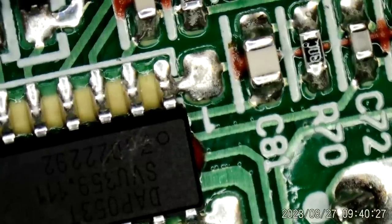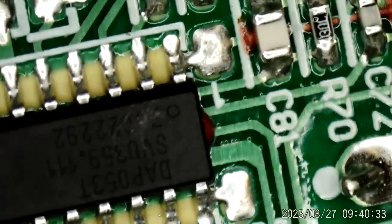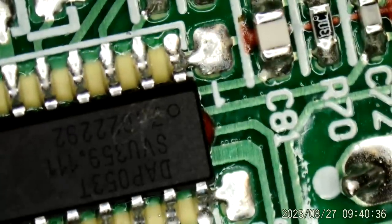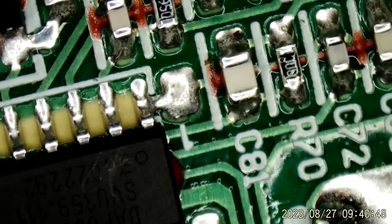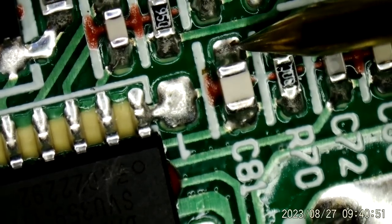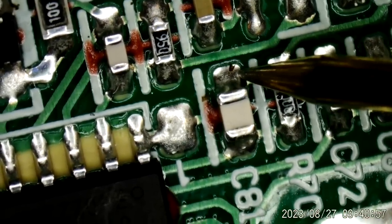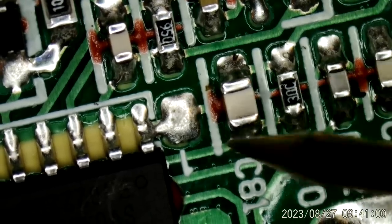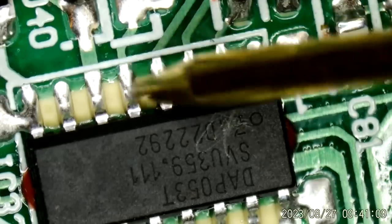Let me see. Let me get to continuity mode. Let me null this out because I want to know if that happens to be ground. Maybe we can tell. So, is this in ground? Yeah, 0.00. And this end is 2.9 ohms. So, this is ground. And we have basically a 3-ohm short to ground right up here. We still don't know where this goes. Wherever it goes, though, we should read 3 ohms. Nope.